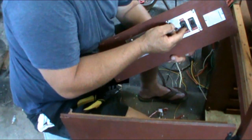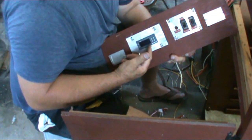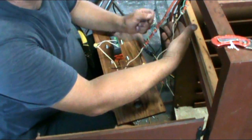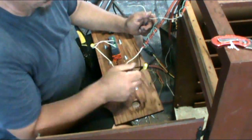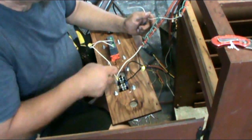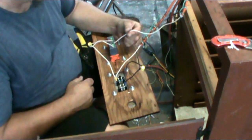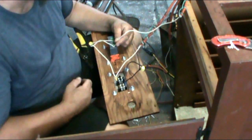The way I'm going to do this, this switch is not only going to turn the fan on, it's going to add power to this. Main power cord coming in, all the blacks together. Now, when you turn this switch on, it turns the fan on but it also turns this unit on.